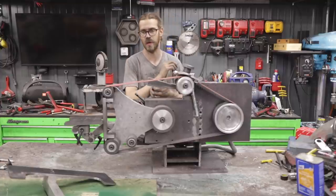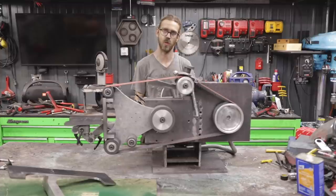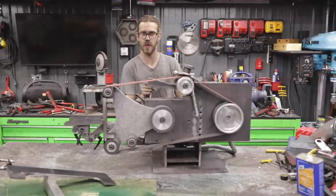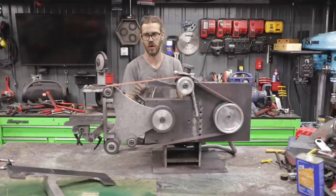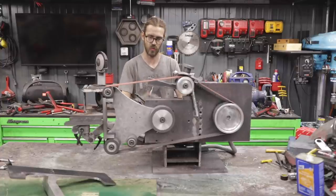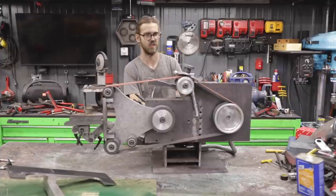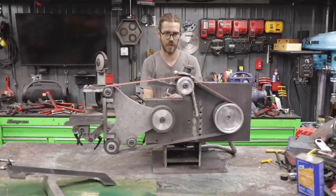The other thing that basically told me that it wasn't aligned properly was when I would go from forward to reverse, the belt would move way over, like a half of an inch. Now there is gonna be some direction of movement, but the better you have this tracking, the less movement. So on certain settings, I can go from forward and reverse and the belt slides over like an eighth of an inch, very negligible. You can basically dial that in up here.